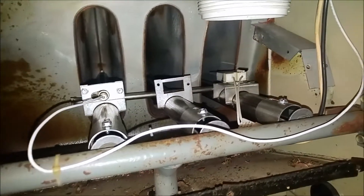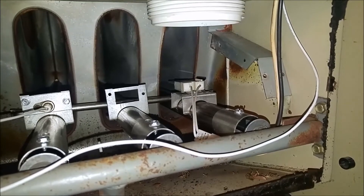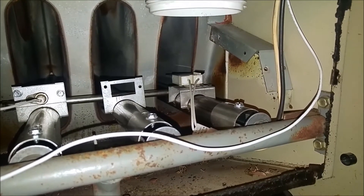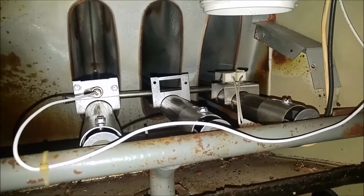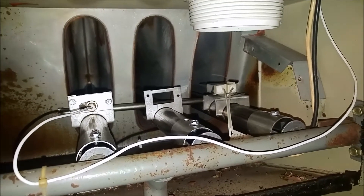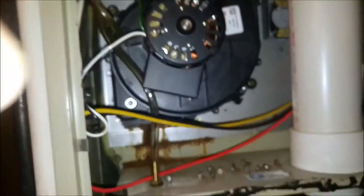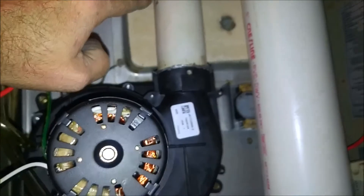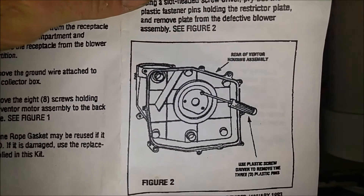And I can come on any time this week. Just waiting on the control. It wouldn't make the pressure switch. It would only make the pressure switch if I had the exhaust off. Maybe I should read the instructions, because it's got a restrictor plate it needs in there. I didn't put it in.